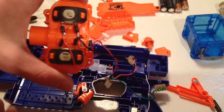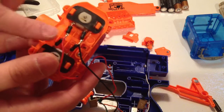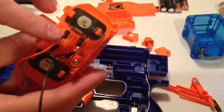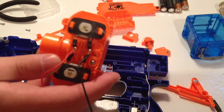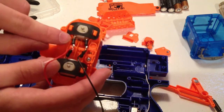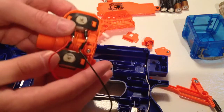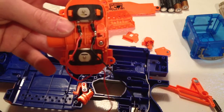On the main motors itself, which I've already removed the screws to, you actually have 4 resistors in line. Basically, I will be replacing that with straight wire after desoldering it. So I'm going to go do that now so that I don't have to waste your time on camera, because I'm trying to keep the length of this video short. So basically just remove these 4 resistors and put a piece of copper wire just in between, keeping the same polarity, so the positive would be on this side and the negative would be on that side. I'm going to go do that now.